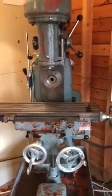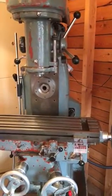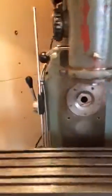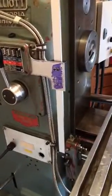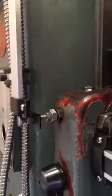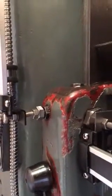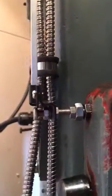Here's a completely unedited video on fitting the DRO slides to my mill. First of all, we've got the vertical slide — this part is stationary and mounted here. Looking at the knee, I've clamped it to what was a grub screw, so a normal screw does the same job. Once that's tightened and locked, I can completely adjust the position.